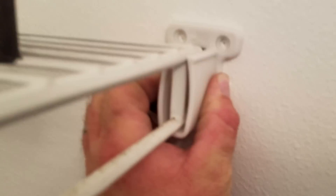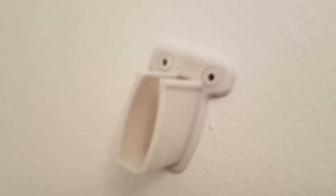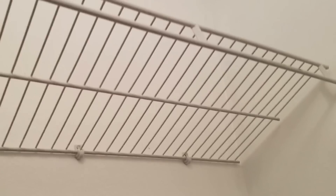Same thing on the other side. I've got it level, got my bracket there, I marked the pencil holes so I can drill and put this side in. Remember these anchors go through the bracket into the wall. Now when we nail them — put the nails or screws, screws are even better. Okay, let's see how this fits. Look at that — perfectly level. So we've got that one up, and we've got that one. Now we've got to put a couple of supports.